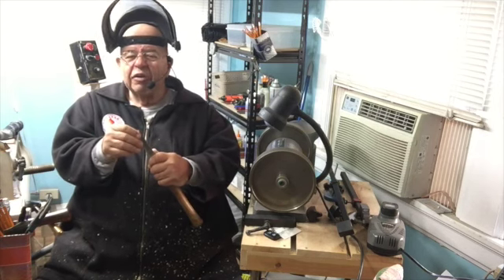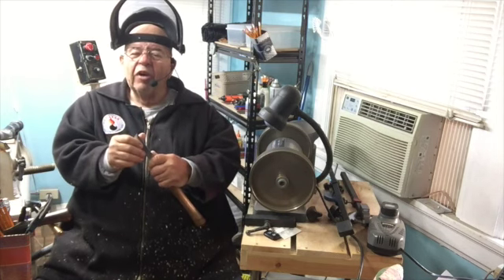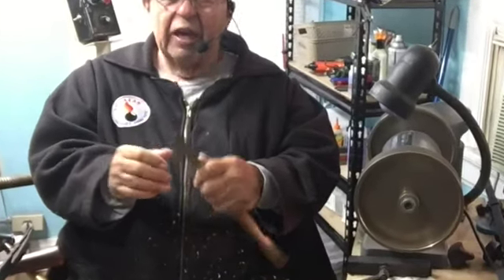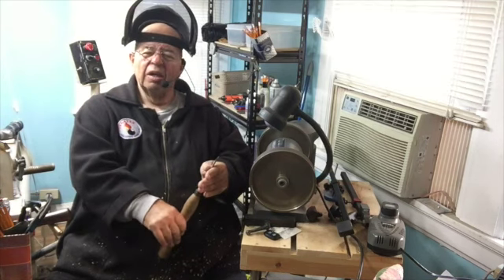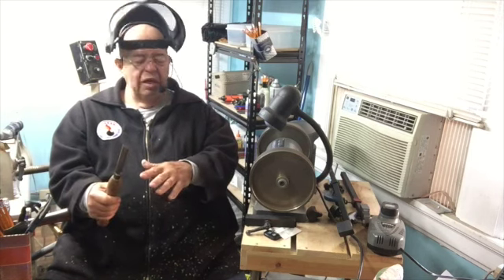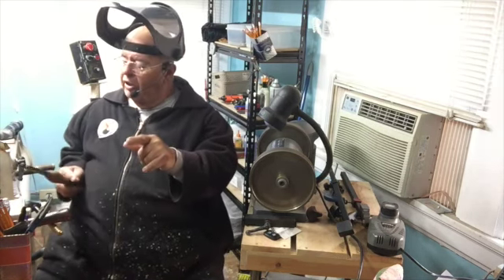The combined angle of this skew is about 25 degrees. If you have a jig and you go 28 degrees, you're fine. If you go 30-35 degrees it'll be like beating on a hammer, and if you go really fine you won't like it either — 25 is about where you want to be. Even if it's curved you can do it. It works. I don't need a jig, just a grinder.